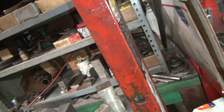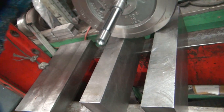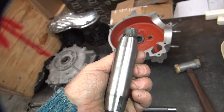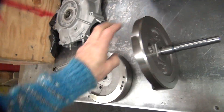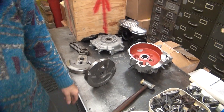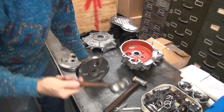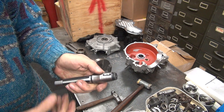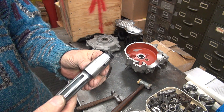That one didn't blow out because the key held it in. The shaft's down here somewhere. Looks fine. This one needs to be tapped out past the key. Take the ball peen and just lightly hit it — sometimes works. Key looks fine. Tight.